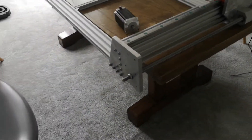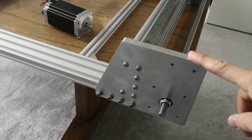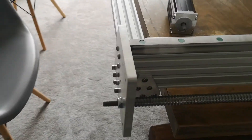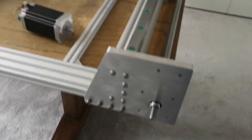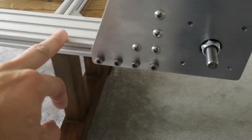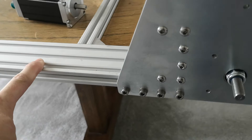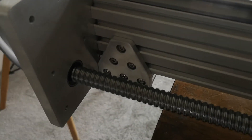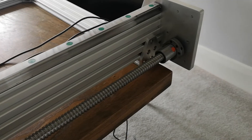So let's have a walk around the unit itself. To start with, we've got a 12mm thick hanging plate as the front — this holds in place the bearings and the ball screws along the front. This is screwed into the Y rail with six screws holding that in place. Below that we've got four screws holding it into the 60-20 bottom support, and down the side I've put in a couple of additional screw points — a six-screw bracket which holds everything in place, and that's mirrored through all four corners.